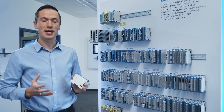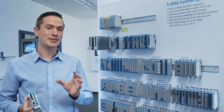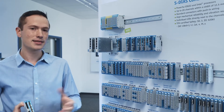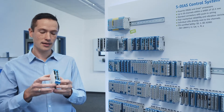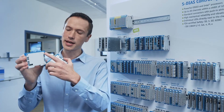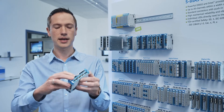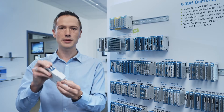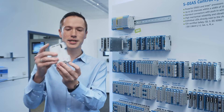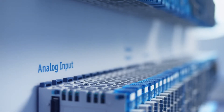Mechanically, the system is well-known, well-loved, and very stably designed to be operated with as minimal tooling as necessary. The stability in the system is greatly thanks to its interlocking mechanism. The cards basically interlock to each other by connecting with these four brackets on the corners. If I push them together and press down on the mechanical lock, they are really robustly connected together. They can then simply be slipped onto a DIN rail and pressed down to attach, and they have an earthing pin at the back as well. You can really see the amount of cards that have been developed for the SDS system up to this point.